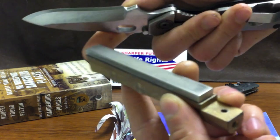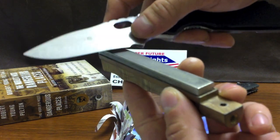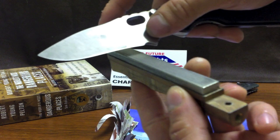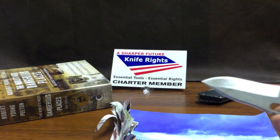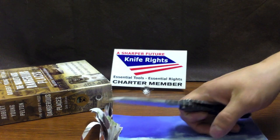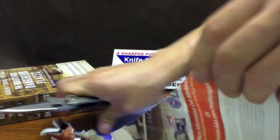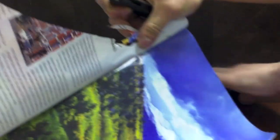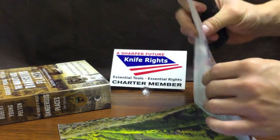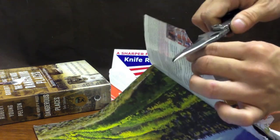And then I've noticed too with this kind of steel that after getting the bevel set, when you sharpen it, eventually you might want to consider raising it up a little bit and creating a micro bevel. And that's the main thing, is when these chip, man, tool steel blades are just, wow, hard to deal with. It's a whole new ballpark. I think most people, if you only knew what it's like to sharpen tool steels, it's crazy. But let's see if I can show that at least it's decent.